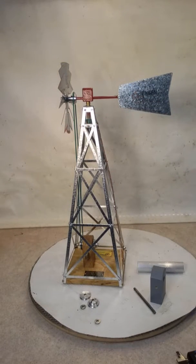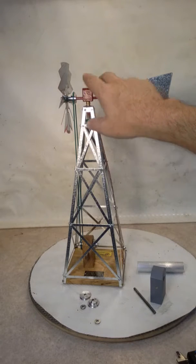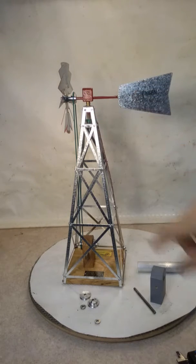The turret right here has been threaded. That's very hard to do because there's really no jig that can hold this thing. It's amazingly tough metal, and I haven't bent or broke anything yet trying to thread it. But I hold it in my hand and have the die and the lathe and just kind of slowly thread it in there as straight as I can. And after a while, it'll thread straightly. But like I said, it's 1/4 inch by 28 TPI.